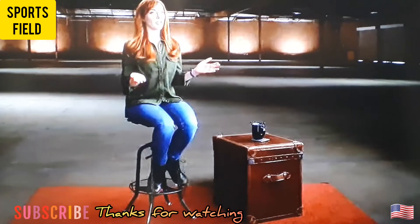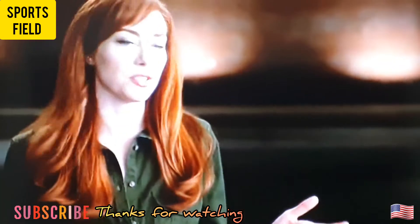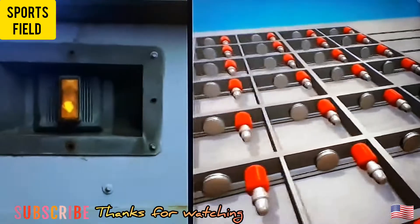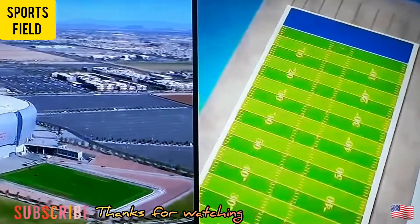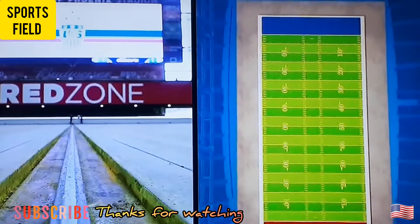So mechanically, how do you get a football field from one place to the other? It sounds like a terrible riddle, but it's actually just math. The movement of the field is controlled by 76 one-horsepower motors. Those might seem like they're not very powerful, but it's better to have a lot of smaller motors as opposed to a few large ones because it distributes the load more evenly over the whole field, and it makes it less likely that those individual drive wheels are going to slip on their rails.